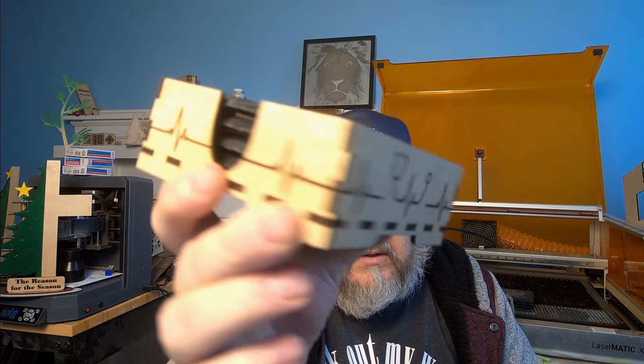The black layer is what I use for the engraving. I did this with a 10-watt diode laser, very low speeds and very low power, and get a really dark finish with the box. Then I used two different layers for cutting out the piece — the 01 blue layer and the 02 red layer. Let's jump over to Lightburn and show you what they are and why I did what I did.